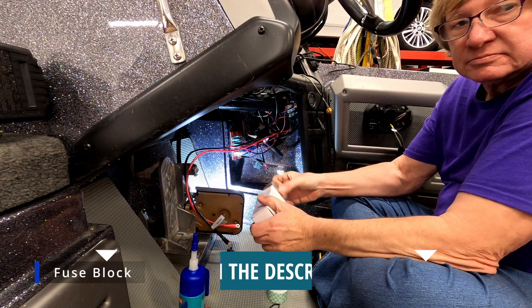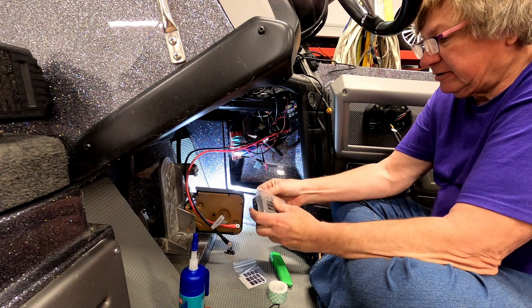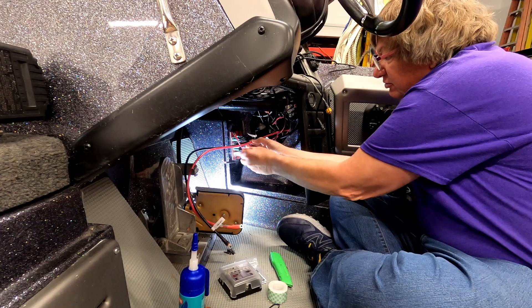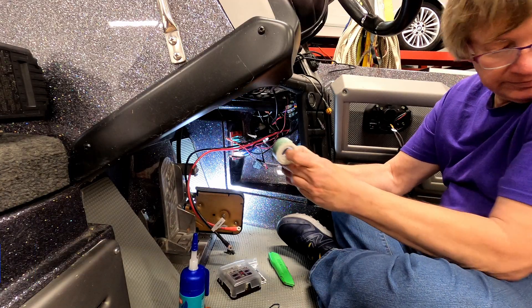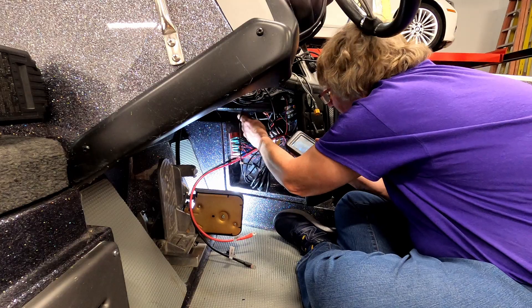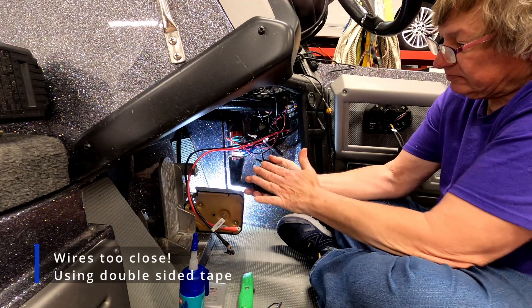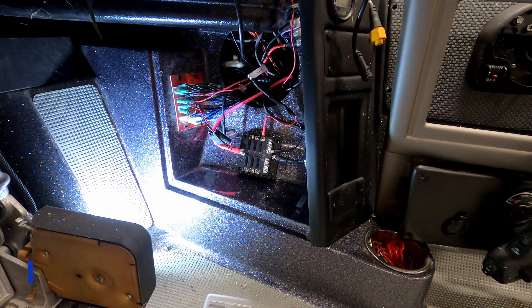Now here's the fuse blocks — I'll put a link in the description down below so you can see that. Now what I'm trying to figure out is whether those screws will fit so I can screw the thing to the wall. Turns out I used an endoscope and put the lens back behind the wall there. The wires that were coming up from the stern of the boat to the console were really too close. So what I have to do is use double-sided tape — 3M double-sided tape — mounted on the back of the fuse block. So now that console area is ready to test.